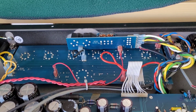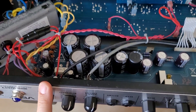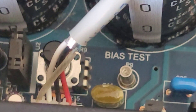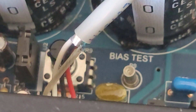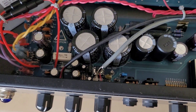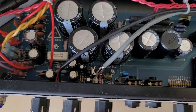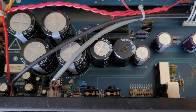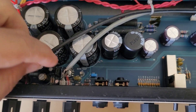Two more minor things to be aware of. To bias this amplifier you need a bias probe. They do give you a bias test point, but that's really not going to tell you much — it just shows the negative voltage applied to the grids, not the current. You need to know the current, and that's where a bias probe comes in handy. Also, the fixed bias potentiometer is located right next to the high voltage capacitors. There's not a lot around there that your finger is going to accidentally touch, but it can potentially shock you very hazardously. I wear a rubber glove when I do this. It probably would have been better placed somewhere more open, away from the high voltage caps.